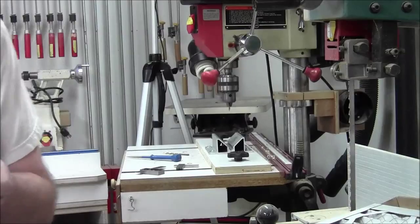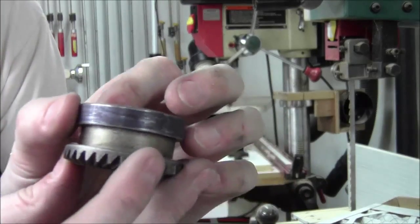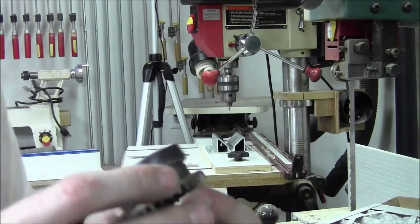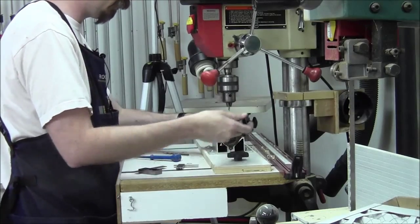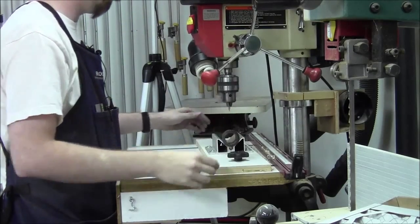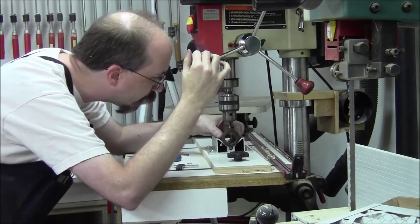We've put some Sharpie on the bridge of the gear that we're going to cut. We're going to drill and tap. I don't know if you'll be able to see my little scribe line — there's one there, and over here. I've basically divided it up into thirds, or as close as I can get to thirds. Now I've got my little v-block set up again. I'm going to set it on here — we're not quite centered, so we're going to have to come over just a bit. I'll bring that over and start the center drilling from here.